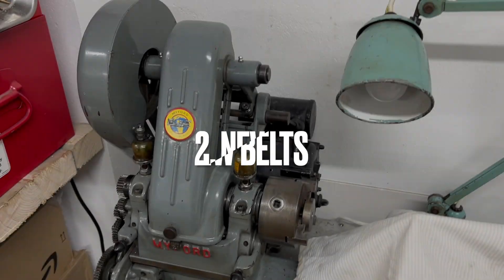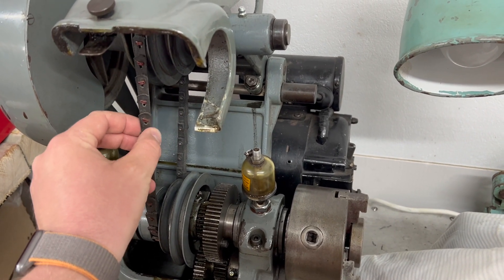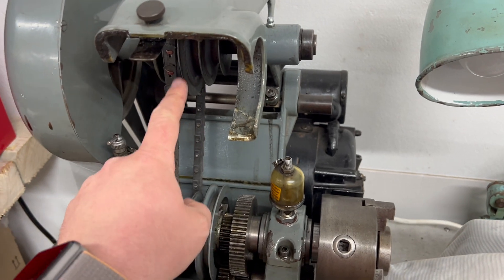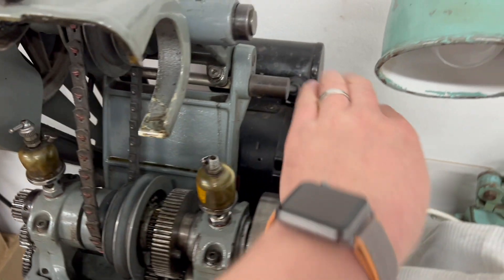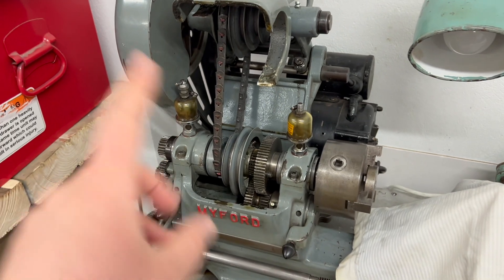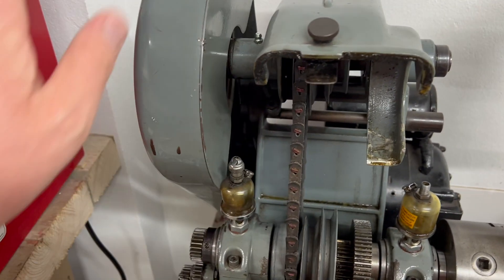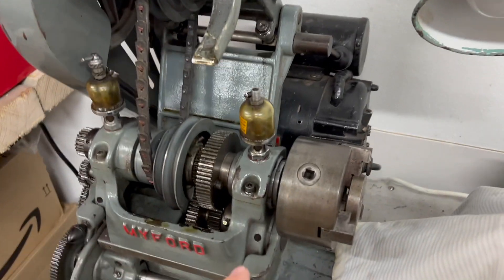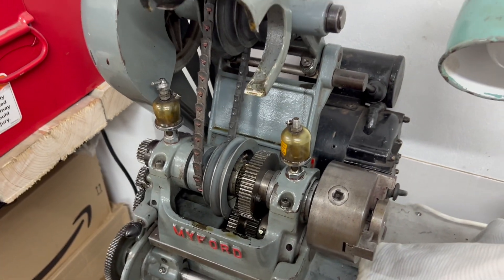The next thing I'm going to do is change the drive belts. I don't think this is original, but I understand why it was put on — it means not having to remove the spindle or counter shaft, as these belts come apart and can be put on separately. But it's just not quite right. I think two new belts properly tensioned could really benefit the machine. We're going to have to take the counter shaft off, take both covers off, take the spindle off, and put new belts on. I've ordered some imperial Allen keys to get those off, and I need to be careful with the bearing shims.